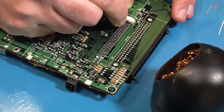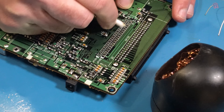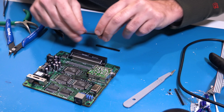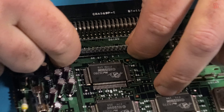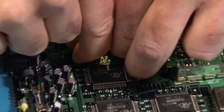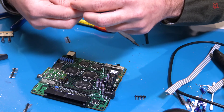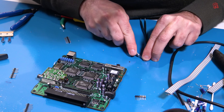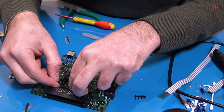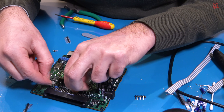So how should we reconnect our HU card reader? The pitch between holes is a standard 2.54 millimetres, so I quite like the idea of putting a header in so we can detach the two halves of the PC Engine if we want. You'll also notice the two rows of holes are not completely in line — they're slightly offset — so you need two separate rows of headers. When I tried to put mine in, even though advertised as 2.54mm pitch, they don't quite fit — if you put an entire row in it kind of bends in the middle. So I split the header into smaller chunks and shaved a little bit off the edge to bring it back into line, making sure all pins are even and none sitting too proudly.